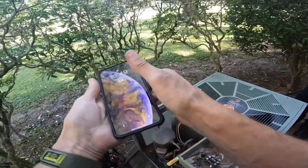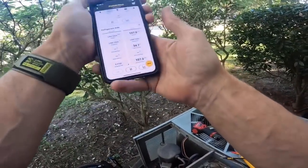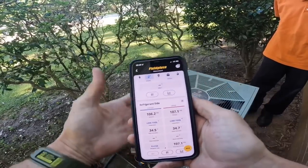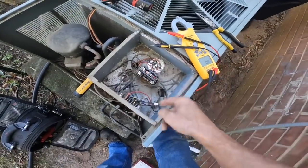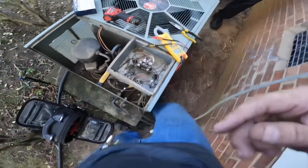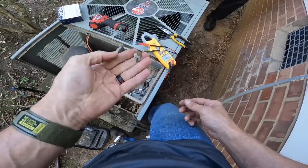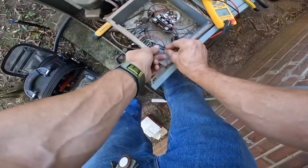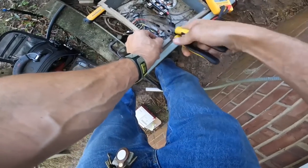What will be your overall recommendation? Are you at that point yet? Standing pressure on 107. I'm gonna put my reversing valves on the jumper here. I was gonna put them on one of these splitters. But I hear it clicking now.